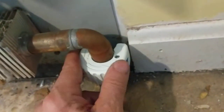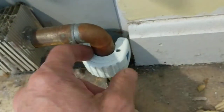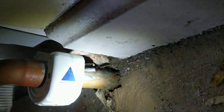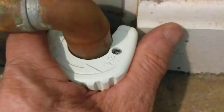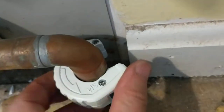I'm not all the way through but I'm getting there. I took the cutter off and turned it around because in one direction it was binding up and not wanting to turn. This soldering job was probably not fantastic — you can see the plumber did not wipe this joint down so the solder is a little irregular. The cutter should make it through, but I'm running it back and forth and reversing it, adjusting to try to get a clean cut.